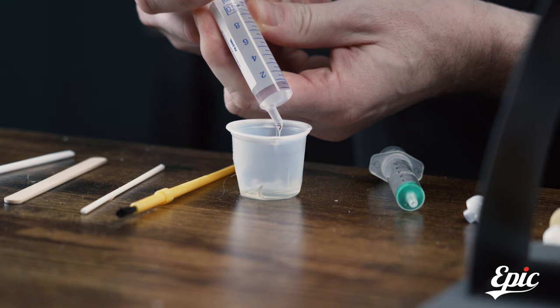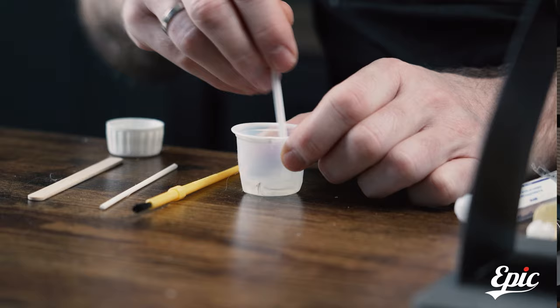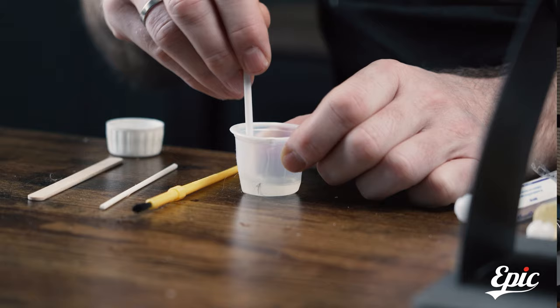You should also have the epoxy not too cold. You should have it at least 21 degrees. Just like this. And then I will mix it for 5 minutes, but you don't have to be around for 5 minutes. So I come back when 5 minutes has gone. 5 minutes has gone.